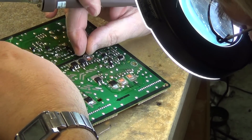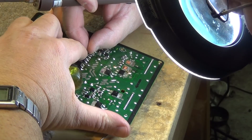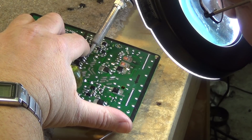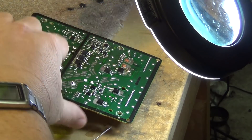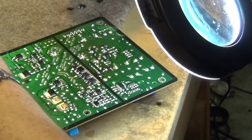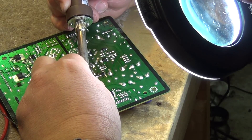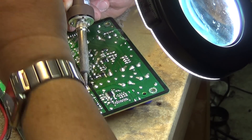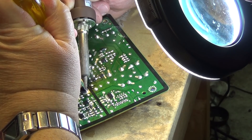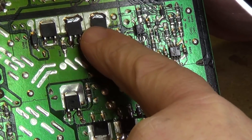Repeat for all four transistors. To solder down the tabs I'm just going to heat them up, and once the solder flows, push them down onto the board. Solder down the emitter, base, and then heat the back of the collector up. When it gets up to melting temperature the solder will flow under it, then just push the part flush with the board to get a good connection. As you can see, there are our four transistors replaced.